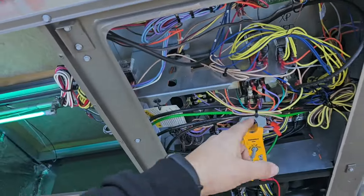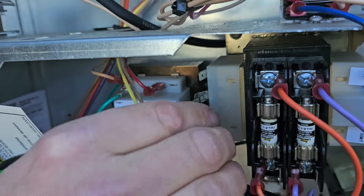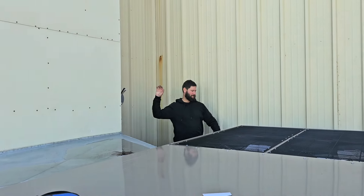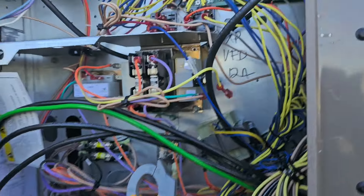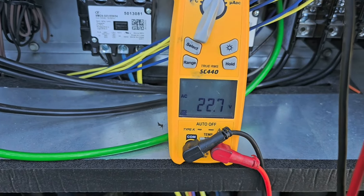Now I'm going to turn the breaker off and change the location of the wire from 460 to 575. Disconnect off — moving from 460 to 575 — then the disconnect back on. Now with that wire moved, we're going to measure the voltage from common to 24. And what do we have? 22 volts. The voltage changed — the voltage went down.